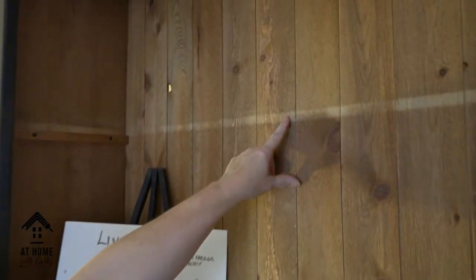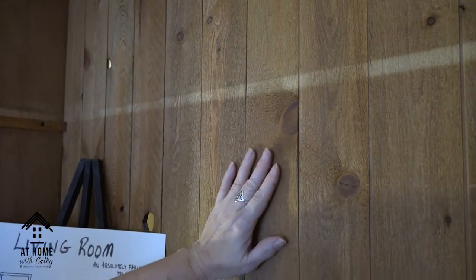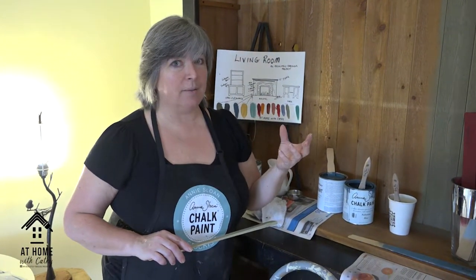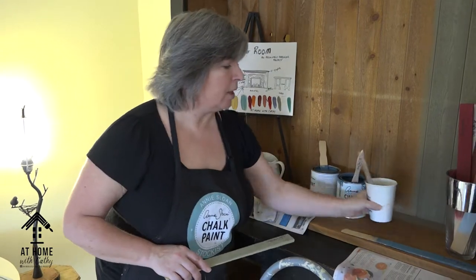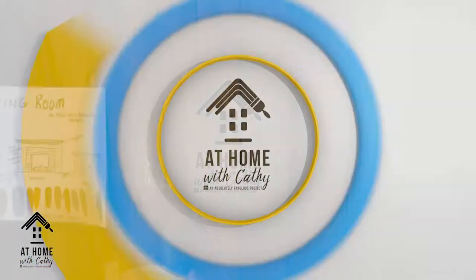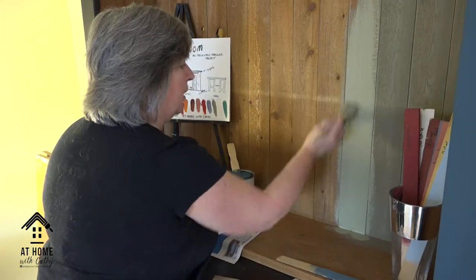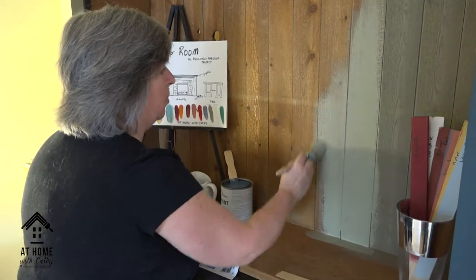You can see where light has darkened the wood over time, and where the shelf has always been the wood is still pale. It's also very rough, meaning it's going to absorb a lot of paint. To counteract that, I'm going to use the paint as a stain — I've mixed half paint and half water, half a cup each. The color we're using is Chateau Gray, and I'm using the small round brush.